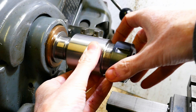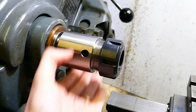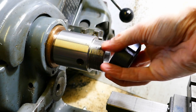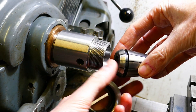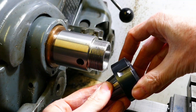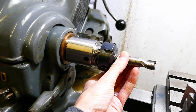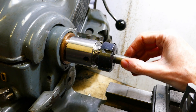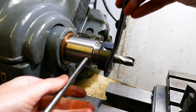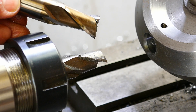I'm now using a collet chuck in the headstock to hold some slot drills. This one screws onto the spindle nose. This is an ER32 collet, 15mm diameter. It fits into the locking ring and then screws onto the chuck. I'm using slot drills to drill out the holes because I didn't have any large enough drills, and these ones are too big for the drill chuck.